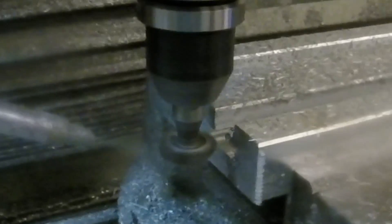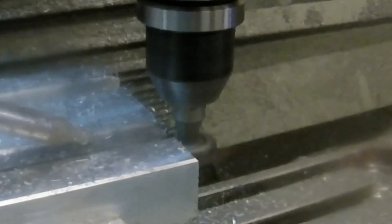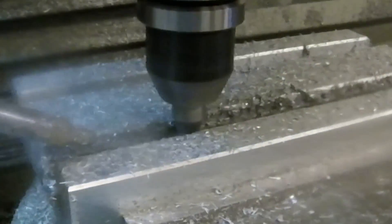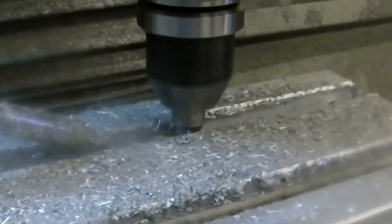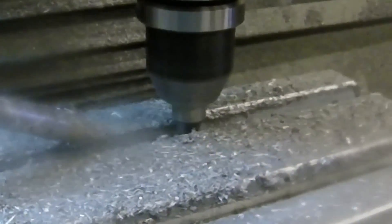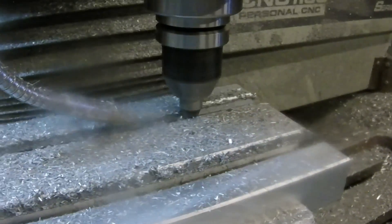The keyway cutter is undersized so I do have to make two passes to get the right width and two more passes to get the right height. Like I said, a T-slot cutter would be better but I don't have one. Here we are cutting the other slot — once I got it figured out it really did cut nice, a little loud but made a nice cut. That's our last cut on the top slot.